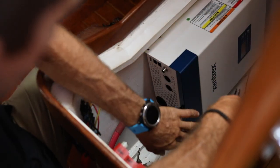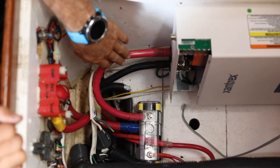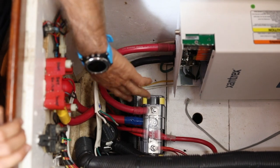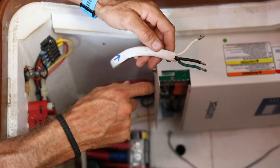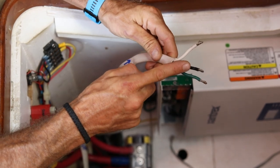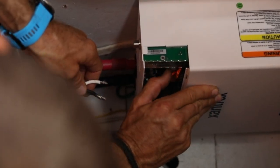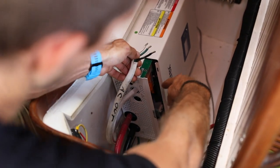Now with the unit bolted up, we're ready to start our wiring. We'll start with the DC wiring — running the negative first, then the positive. With the DC side connected, make sure your DC positive is connected to the positive terminal and the negative to the negative. Once that's double-checked, you can switch over to the AC side. Find your AC input — ours are labeled. We want to make sure we have our white neutral, black live, and green ground, which is the US wiring code. Then the same thing for our AC out — plug it into the switches.